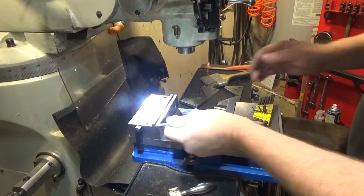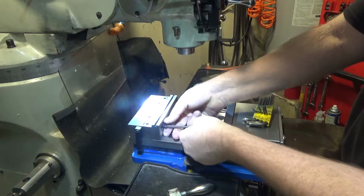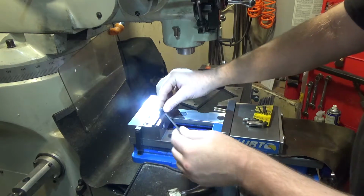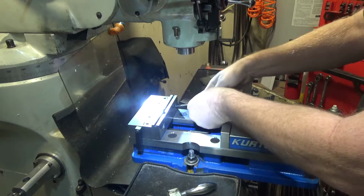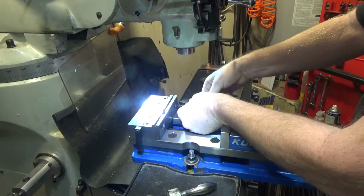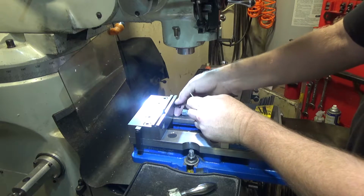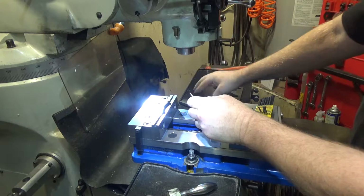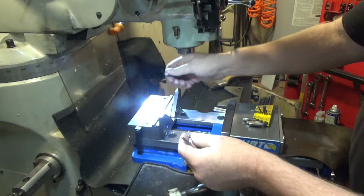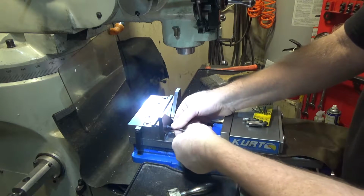Next up, I'm going to take advantage of some ideas I stole from Tom Lipton in a project I did a little while ago, which is the drill and tapped screws. The 1/2-inch screws that hold the vice jaws on have been drilled and tapped to support 10-24 screws. And actually I was kind of nutty when I did this, because I did 10-24 on one side and 10-32 on the other side, because I didn't remember what I did, which is just silly. But I made these 45 bracket holders here, and they'll hold parts at 45 for me, which is what I'm going to be doing next.